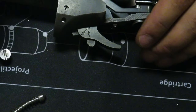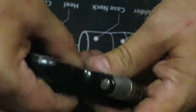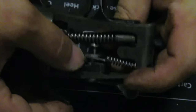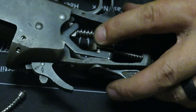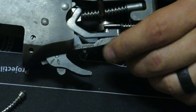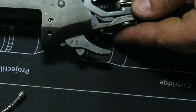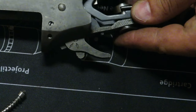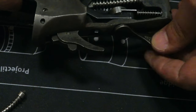Get our screw, put our screw in here — go ahead and put it in like such. Get it started manually — you may have to push down on the lever itself, there's a little bit of play. Get that screw started, get it in down. It should not be in the way — you can see how I'm screwing there. If it's in the way it's not properly aligned, slide it left or right to get it to sit on the edge of this piece. Take your screwdriver, finish getting it in, and tighten this down. Do not tighten it all the way — there is enough gap to play with it, and you can see how it goes up and down.